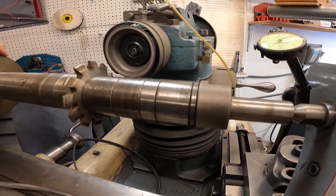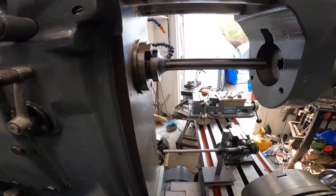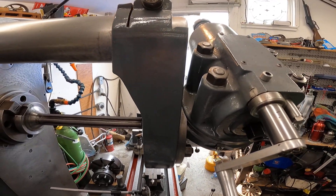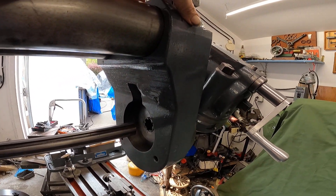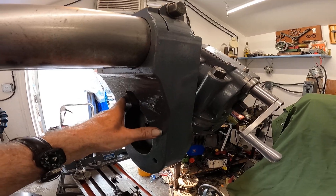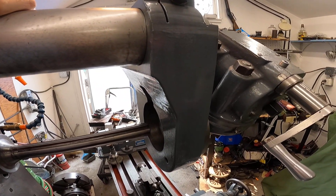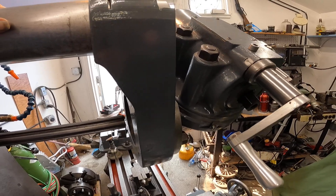So I've got this one-inch arbor and we'll get back over to the mill. This is the vertical head attachment, and one of the things about this attachment is it's really hard to get on and off. The yoke here is probably half again as heavy as a six-inch vise — it's just heavy and so out of balance that to put it on the overarms you really have to disassemble it, get the yoke on first, and then put it all together.